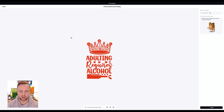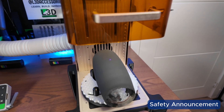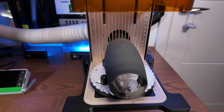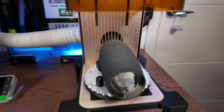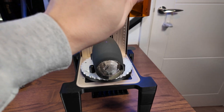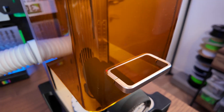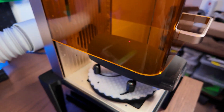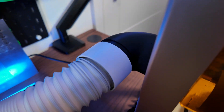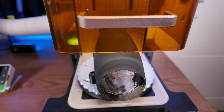Now we know we're framed correctly, click the Process button. We're not changing any of the processing modes — this job is going to take one minute 40, which is pretty quick. Let's click Start. One important point: we are using a blue laser which is very bright and can damage your eyes. Because our glass protrudes beyond the enclosure, lower it as close as possible without upsetting the positioning, and make sure you're wearing laser safety glasses. Also ensure your extraction is set up and working.